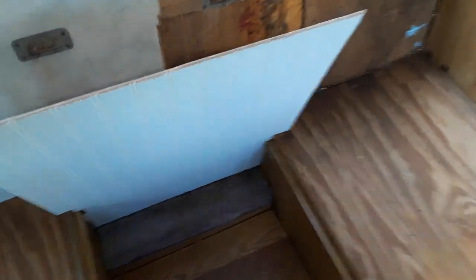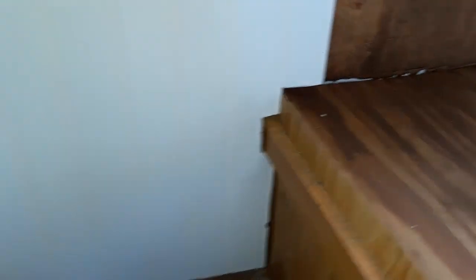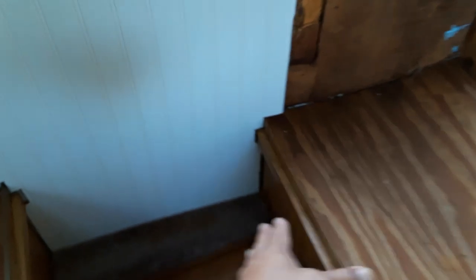As you can see, I have cut this wainscoting. I had to make these weird cuts to try to get it to slide in there. It doesn't have to be perfect, it just needs to be good enough. So what I did was, I basically measured the vertical and I cut a piece of the wainscoting because I had two of those boards. And I'm going to use that other piece to cut the ends that go right here. And I decided to do this instead of cutting a big T-section because that would have been a lot of wasted wainscoting.